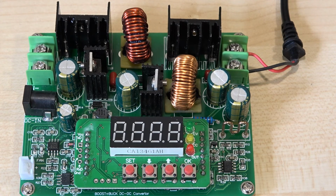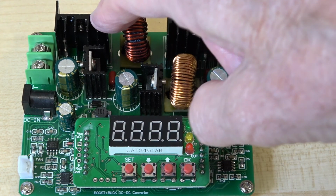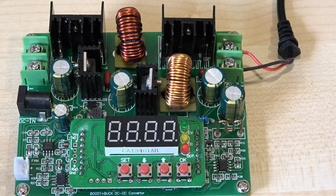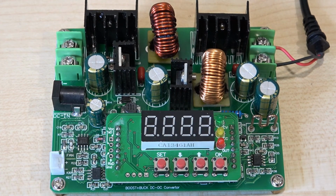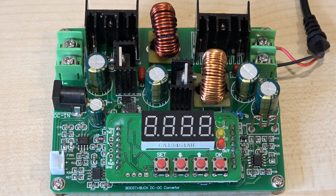I know some of these transistors claim junction temperatures of hundreds of degrees, but when you look at a piece of vintage amplifier or something like that, when they've got regulators on them that run a bit on the warm side, it gradually burns the board, and then eventually the solder connections break and or it blows up. Whenever I've built or used any electronics, I've always made sure that it runs cool. Even if I have to take off these heat sinks and go and steal a manhole cover.